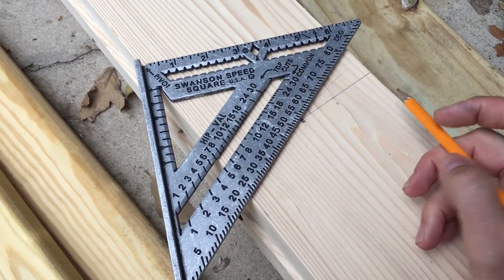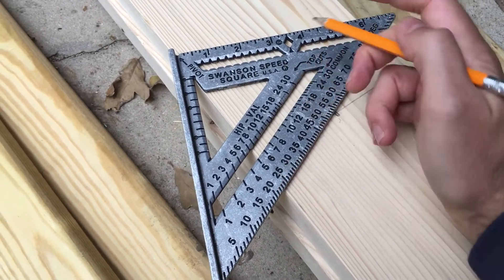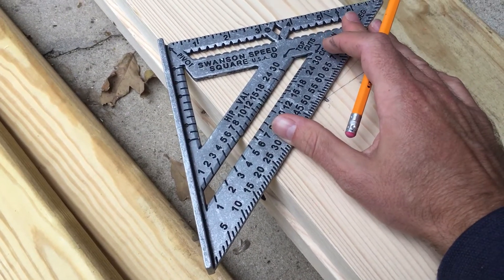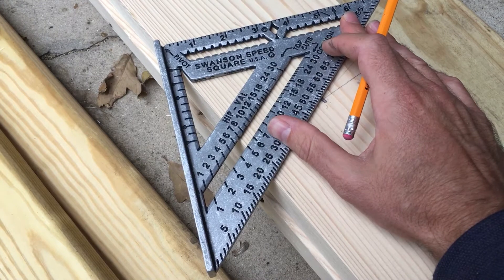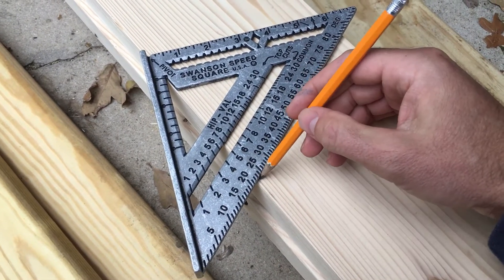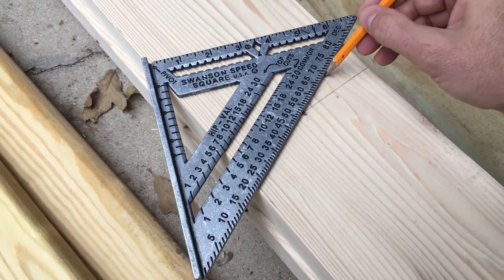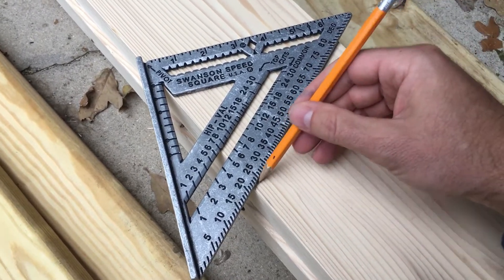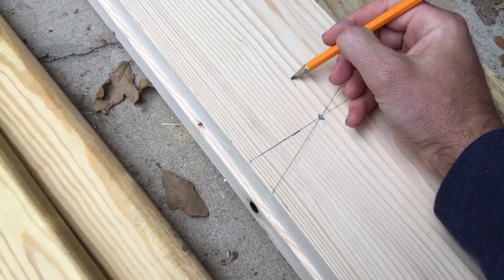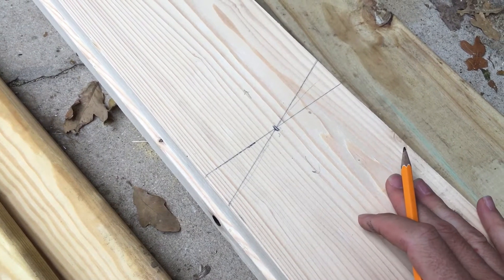The goal is to maximize the wood, reduce the waste, and do one cut. Now that I've got that marked at 22 and a half degrees — coming through here, back down just a touch — that's right on the money. We'll draw our line there and then make our cut. That line will go in both directions and both sides will be the same length, so we can use both pieces for our rafters on this playhouse.